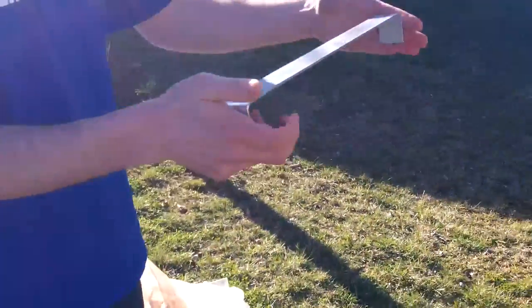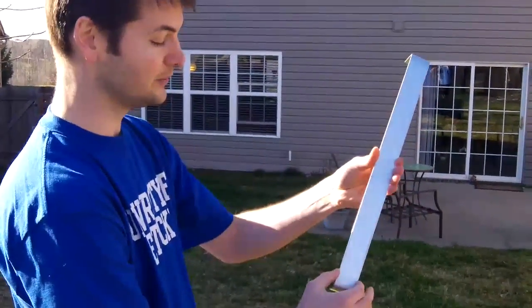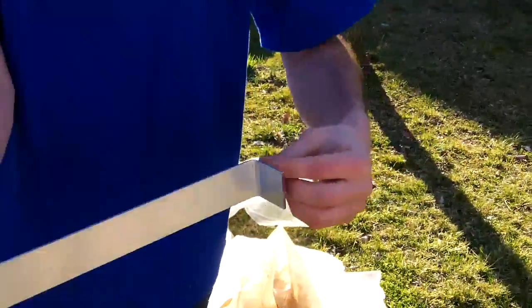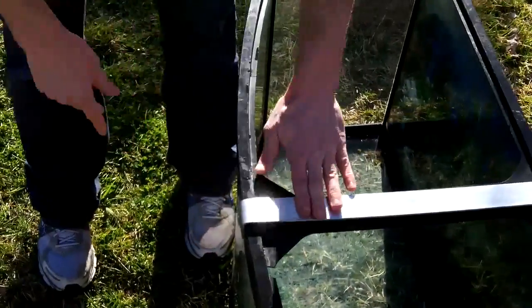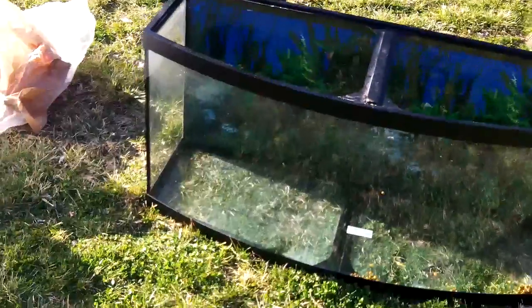This is a two inch piece of stock aluminum — I got it at Lowe's in the little metal section where you can get small stock pieces. I cut it with a hacksaw from one end, measured exactly how wide I need it for this distance, and bent it at a 90 degree angle at both ends using a vise. Once the tank fills up with water it'll stretch a little bit and this will be perfectly tight. It requires a lot of accuracy. I did it on my 55 as well — it's still on there — and it's not noticeable once you fill the tank up.